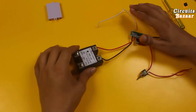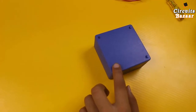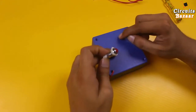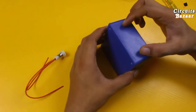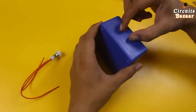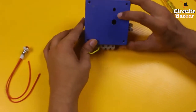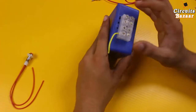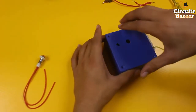This is the antenna — you don't have to do anything with it. Now we will make one drill hole for the indicator and another hole for the toggle on/off. I'll use four connection points for the AC and the hooter, and two more for manually turning the system on and off. I've made the hole for the toggle and one for the indicator, and four connectors to provide AC and connection to the hooter.